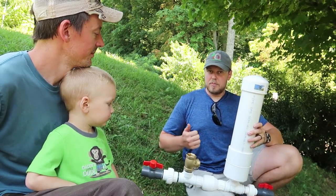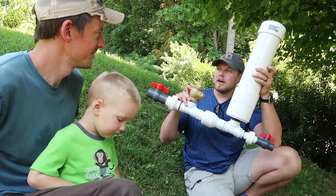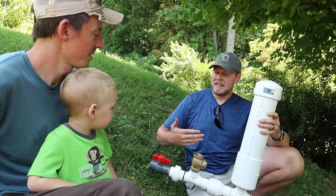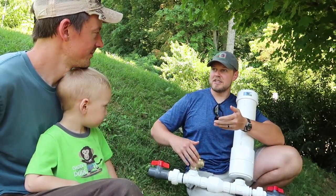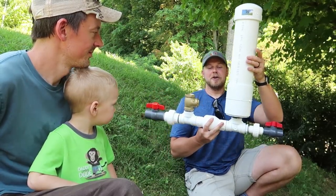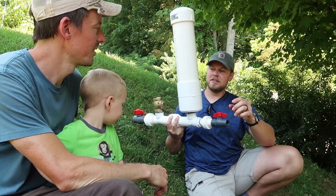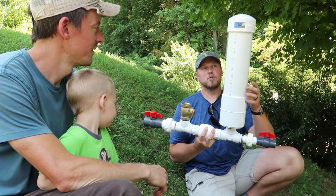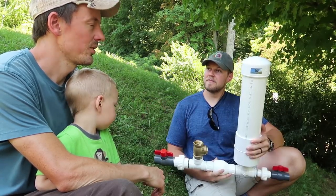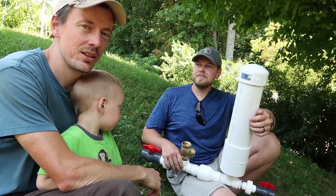When that wave went back up the drive pipe, it created a negative here, so this valve falls back open again. It's waiting for the water to come back downhill — and so it's a constant cycle. You can actually hear it pop-pop-pop-pop. Your ratio of head pressure coming down to lift potential out is about one to seven, sometimes one to eight, depending on the rigidity of the drive pipe. Basically you can push water a lot higher than the water is falling in your creek.